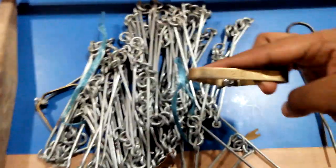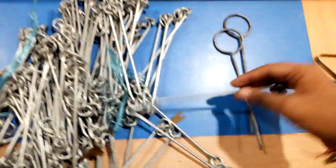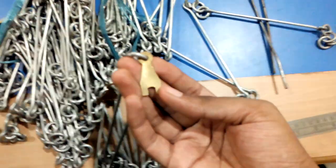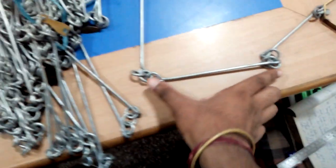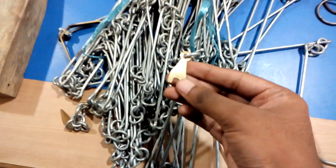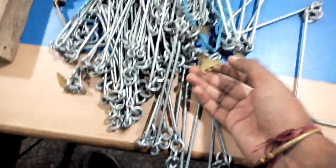This is the 20 meter chain, as you see, on the handle. In this chain, these are called tally — sorry, this is called tally, and this is called link. The length of a link is 20 centimeters, measured from ring to ring. This chain also has tallies which show the 5 meter, 10 meter, and 15 meter distances.